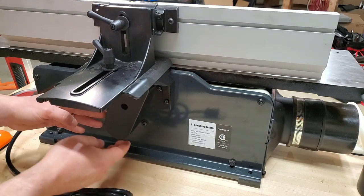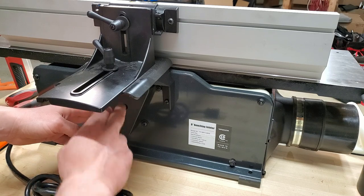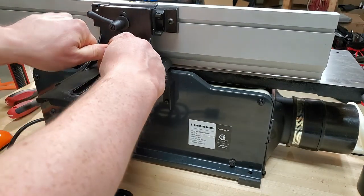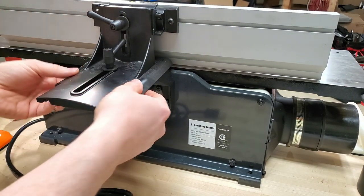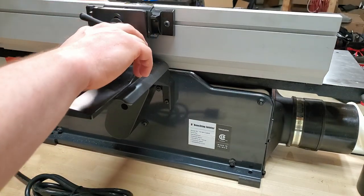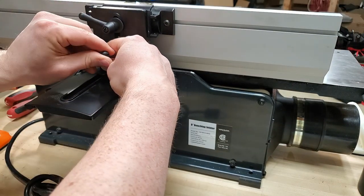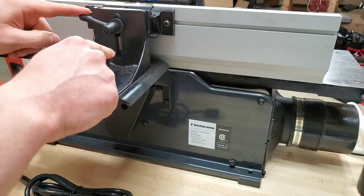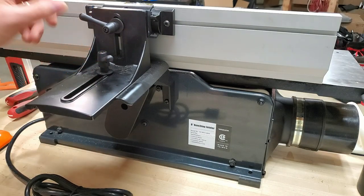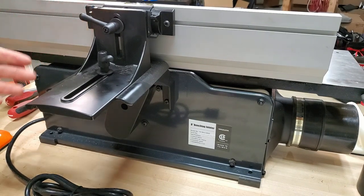On the back is the belt drive going from the 10-amp motor to the cutter head. The cutter head turns at 12,000 RPM. Up here are your fence adjustments — you've got levers that turn to loosen. It's a single-point contact, but it all rides on a rail that clamps down fairly sturdily. If you get stuck and one lever runs into another, you can pick them up, index them, and turn. These adjustment levers are some of the only plastic parts on the entire machine — everything else is essentially metal. They do feel a little flimsy, but so far they're working just fine.